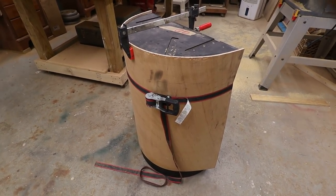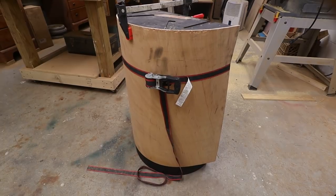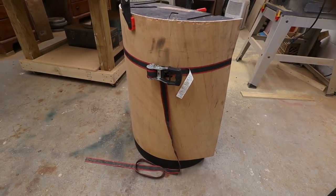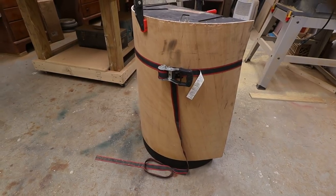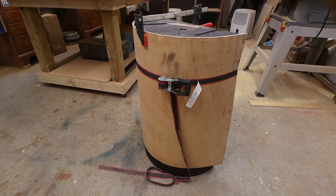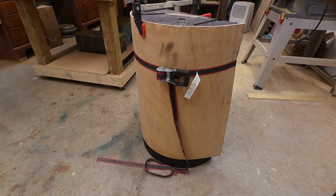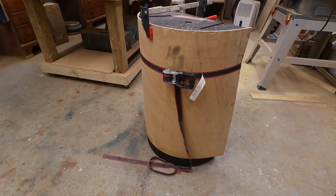I think third time's a charm. So I went to the store and I bought some quick drying, like a spackle type putty, and I am just gonna paint it. So what I'm gonna do is just do a quick once over sanding, just rough it up. Then I will give a nice thin skim coat of that spackle putty type stuff. Give that a sand, that should get rid of any of the low spots. Should level it out a good bit. Then I got some paint and I'm just gonna brush that on. Brush strokes should hide a majority of the dips and valleys, and then do a little clear over that. Should be good. So let's give it a whirl.